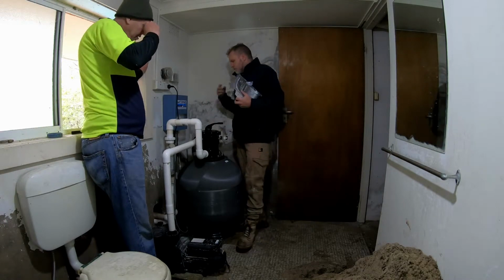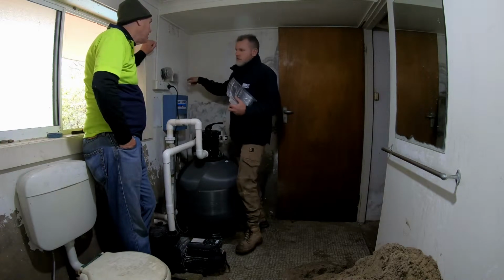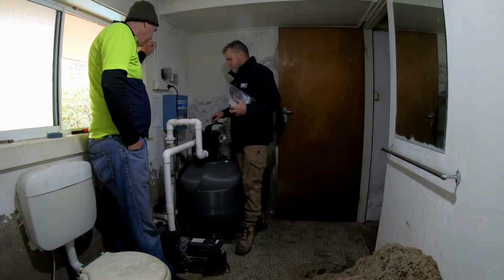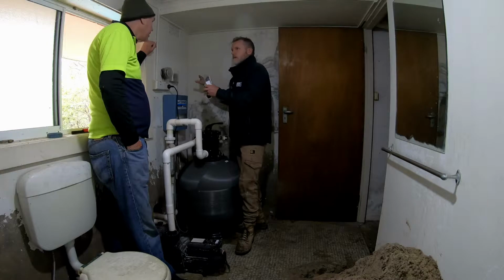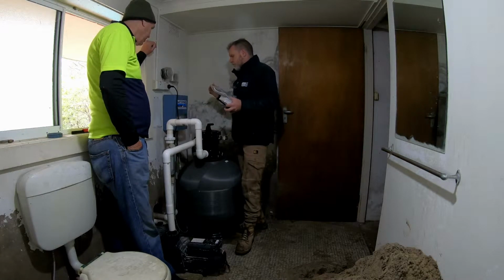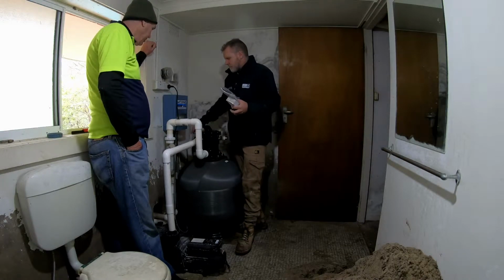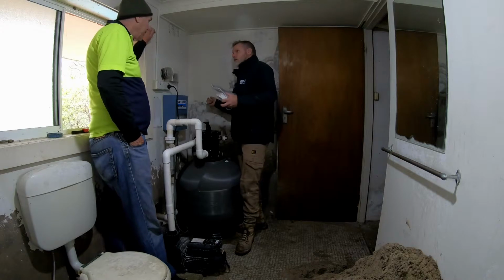The other one, of course, is waste, so you're just bypassing the tank to drain some water. It's obviously pretty cool from the rain. It depends how you do things. A lot of people just go, may as well keep the excess water because it's not wasting it, because everything evaporates eventually. But if you really wanted to, you just put it on waste, and it just bypasses the tank. So it's the same as recirculate would be, except that it's going to the drain.